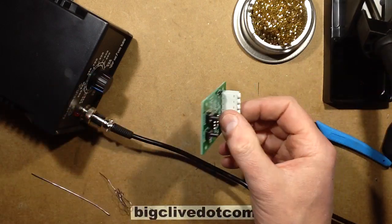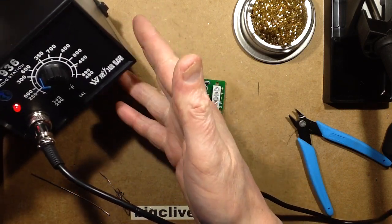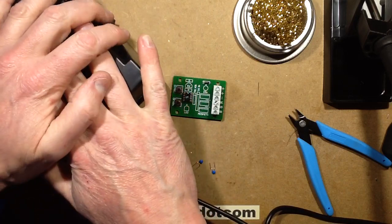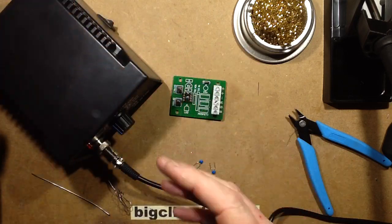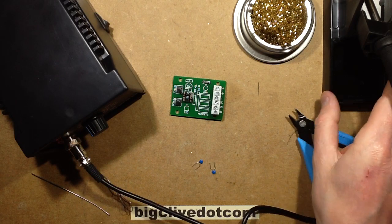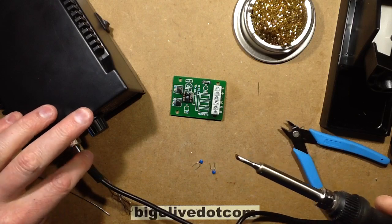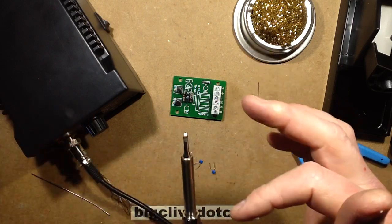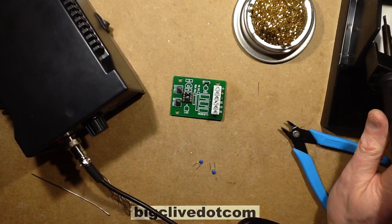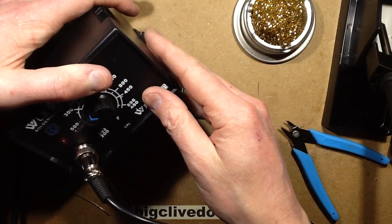That soldering iron is perfect. It's absolutely fine. So for 22 quid, it's a decent station. It's actually quite nice. It's solid. I felt the temperature of the transformer earlier after running it for a while, and it seemed fine. It doesn't seem to be stressing the transformer. It cycles on and off nicely. It's quiet. You can just buy new soldering irons and plug them in. Instead of changing bits, if you were prone to using multiple bits, you could have a soldering iron per bit, although the calibration might vary a wee bit. But on the whole, I would say that's pretty good.